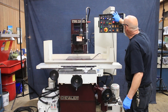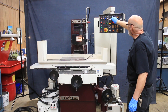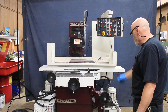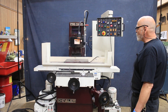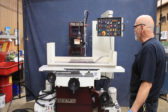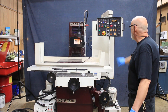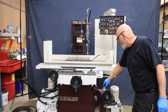Depending on how you have this retraction set here — which is just a potentiometer with many turns — the wheel will rise up at the end of the cycle. So this is a surface grind with automatic down-feed. You can also do a plunge grind where only the table is going back and forth for grinding slots, by setting it on the plunge grinding mode. And you can use it in manual and feed down with your manual jog button, or there's a fine feed on the manual in-feed.